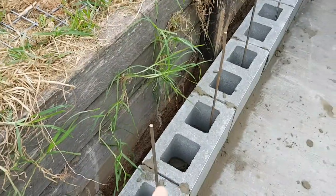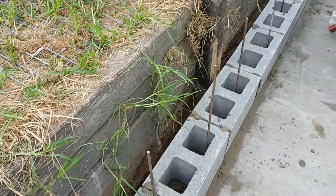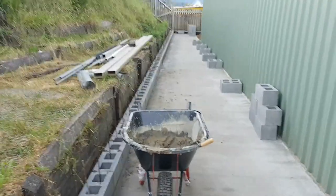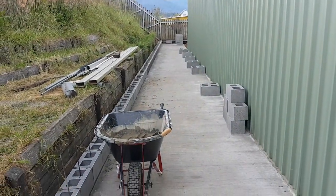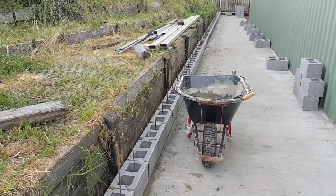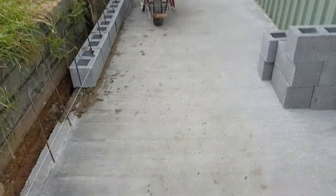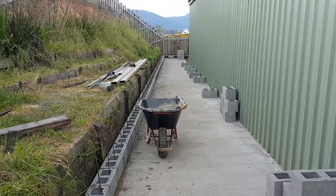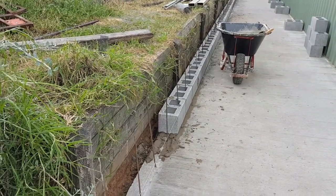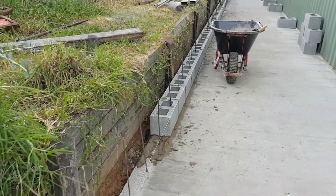When I did this concrete slab, the contractor suggested I put in steel bars as concrete reinforcement so that these blocks could be concrete-filled. In effect, it'll create solid concrete columns going vertically. These concrete columns are going to be a very strong part of the wall. Initially I was thinking about having the concrete slab on its own and then doing something separately for the wall, but running the reinforcement steel straight up from the slab is a great idea — there's no better way to build a footing for a retaining wall given the pressures involved.